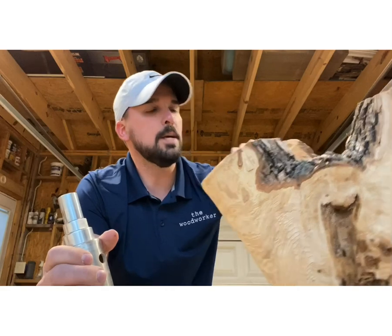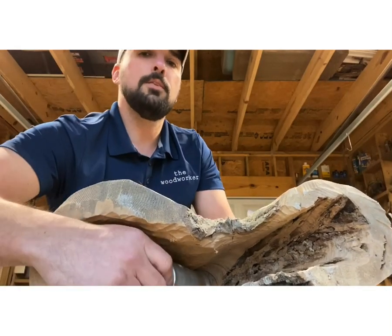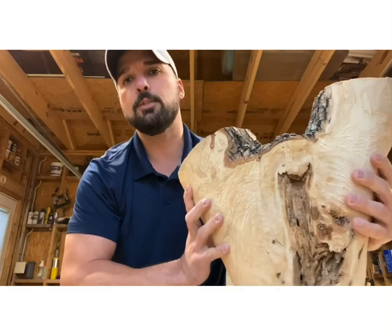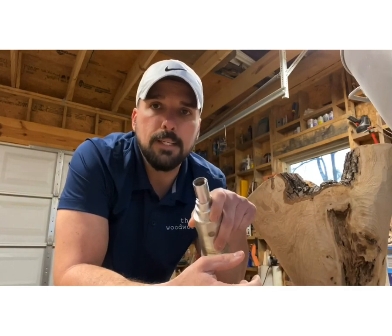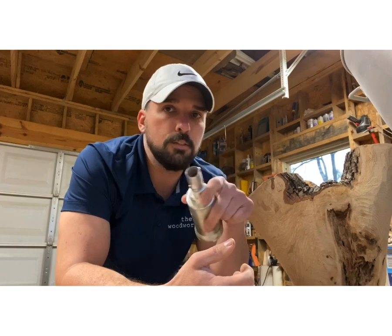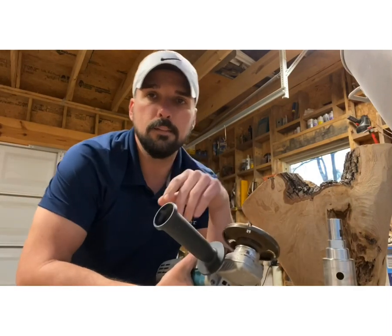This is a three-inch hole cutter. Let me give you an example of why I really like this tool — I'm able to achieve what I would normally only be able to achieve with a wood lathe. The thing I like about this over a wood lathe is I don't have to continuously make round pieces; I can make whatever shape I want. For a piece like this, it's pretty much the only thing I can use for carving on the inside. I'll have a lot of sanding left to do, but for bowls I leave about a half an inch — just like I would with the bad blade — so I can come back with the turbo planer and smooth everything out to the exact dimensions I want.